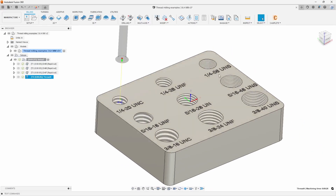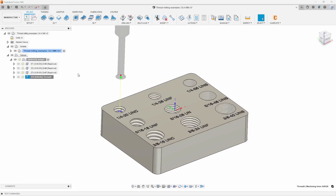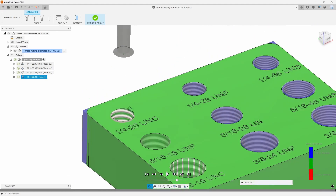That's all we really need to do — we have our tool and our toolpath. Let's go ahead and take a look at what the operation looks like. I'm going to right click and say Simulate, then hit the play button. We can see the tool come in, start from the bottom and work its way upwards. Because we put two step-overs in at ten thou at a time, we should see two passes — and that's pretty much what it's doing. I'll run that through a little bit faster so we can see the end product, and then we also have our repeat finishing pass so the tool comes back in and takes a final pass.